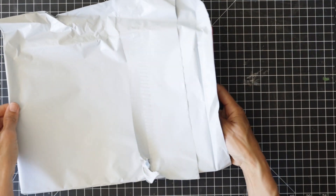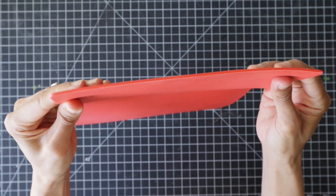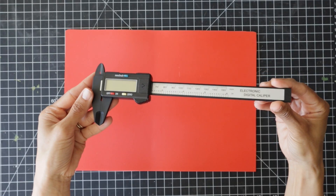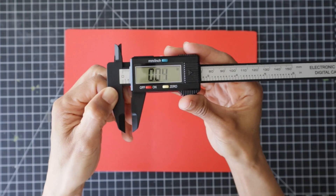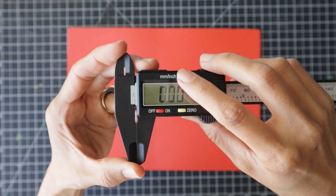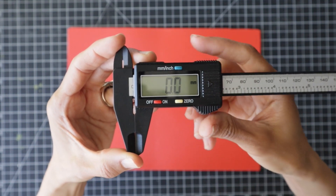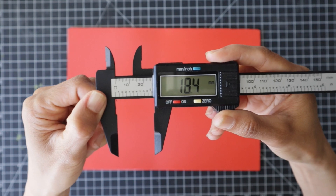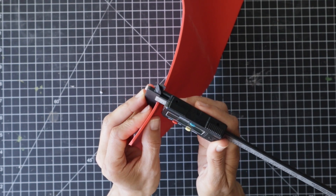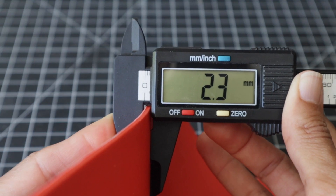Anyways, let's get back into this tutorial. Let's jump into Lightburn and get started. First thing you need to make rubber stamps on your laser is the rubber. I grabbed a couple of sheets on Amazon — I'll link the same ones I used down below. Next, you need to measure the thickness of the rubber. It should be listed in the product description on Amazon, but I just grabbed my calipers to make sure it was accurate. This is a must-have laser tool, especially in the beginning when you are narrowing down the materials you plan to use. Having the exact thickness helps dial in your perfect settings for cutting and engraving.